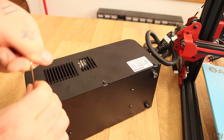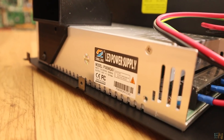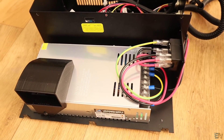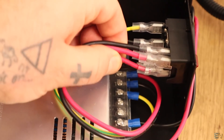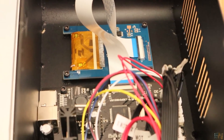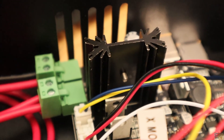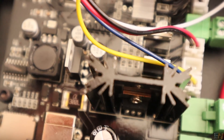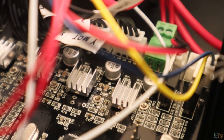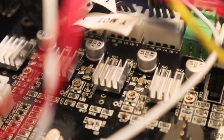Let's open the electronics case — just remove a few screws and it will open. Inside, as I said before, we have the power supply of 24V and 15A. I can see proper cables and insulation for all the connectors. It also has a switch and a fuse for safety inside the switch. On the other part of the case, we can see the TFT display and the main board. I can see there is a big heat dissipator for the heated bed MOSFET. Now the stepper drivers are soldered to the main board below these heat sinks — I really prefer a board with separated drivers, in case just one gets damaged.